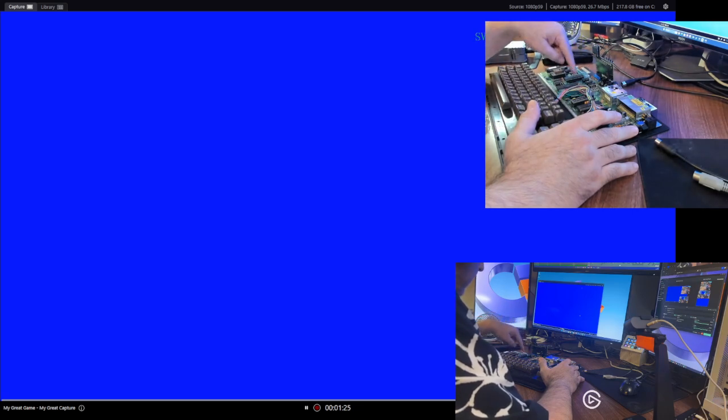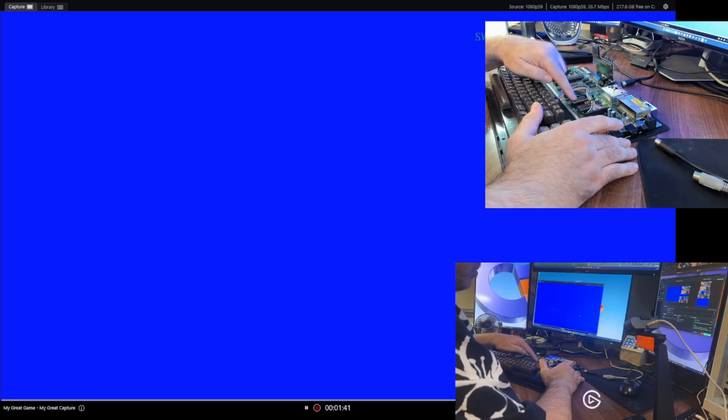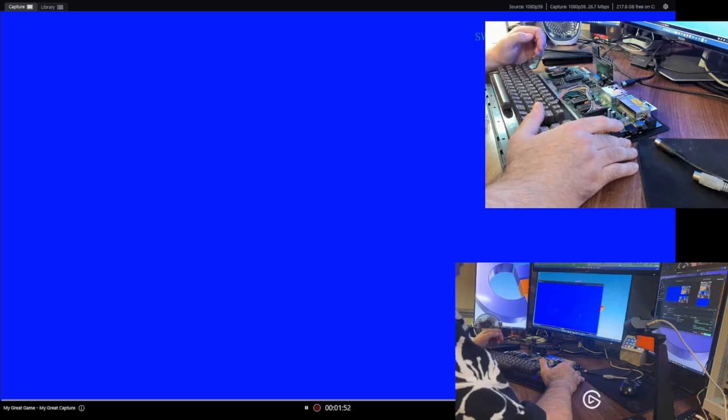So he's got an 8500 CPU, and he's got the VIC-2 on it, the 8565, and a nano SwinSID. Now, this is important. The reason I say this is important is because it being a nano only requires 5 volts. It does not require 12 volts. It doesn't require 9 volts. It doesn't require any AC. It only requires 5 volts. And also, I've got a CIA in there.